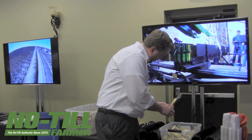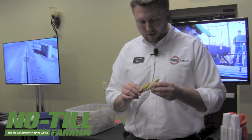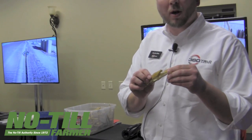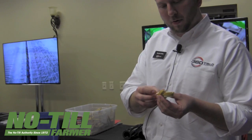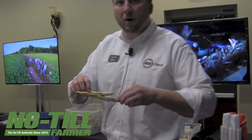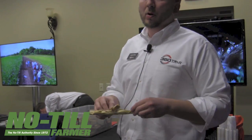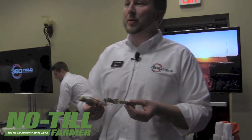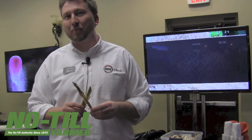I liken this residue to a cocklebur — the way those things stick to your pants or shirt. In the field environment, all these little hooks act like velcro, latching on to each other so that wind causes the residue to become entangled upon itself. This makes it more resilient against blowing in the wind, and water has a harder time moving this residue in a heavy rain — reducing ponding and the residue rim around ponds that you'd otherwise need to manage before going to the field in spring.